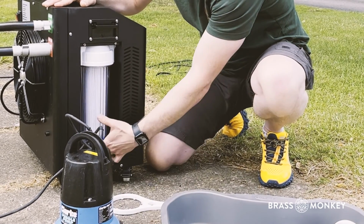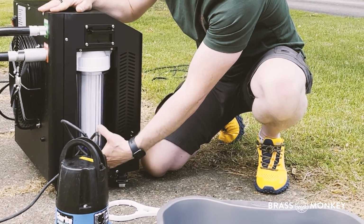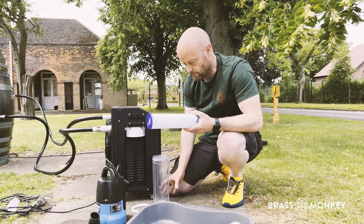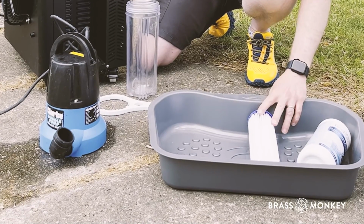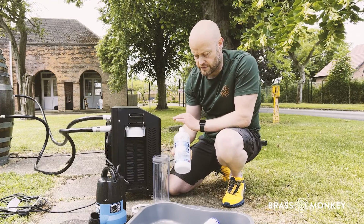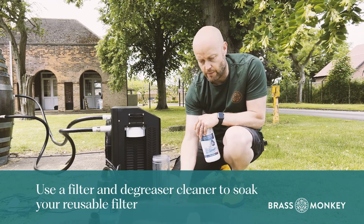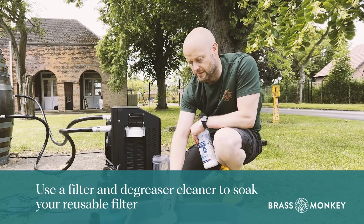spin off our filter. So of course this will be full of water. Our cartridge, which will be dirty, it will look dirty. We put it into a solution such as this Lazy Spa tray, where we've added roughly 5 litres of water with about half a bottle of something like low chlor. It doesn't need to be that accurate. The point is we've got a cleaner in there and we can swirl and agitate that around. We'll leave it in here for about 24 hours.